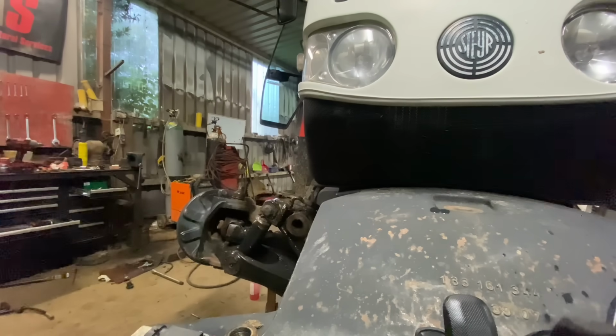When I have the whole hub off, it's going to make it easier for me to beat out the wishbones, or the bushings in the wishbones, like the ball joint. So I'll strip the bottom one there now, and the whole lot will drop down and be able to come out easily, and then I'll be able to beat out the two of them a bit easier.